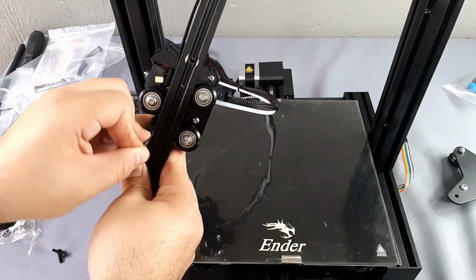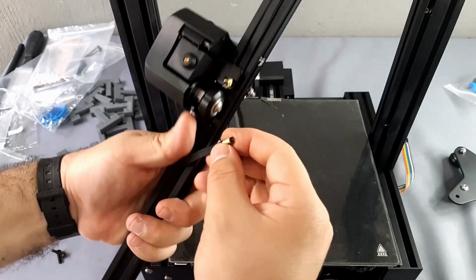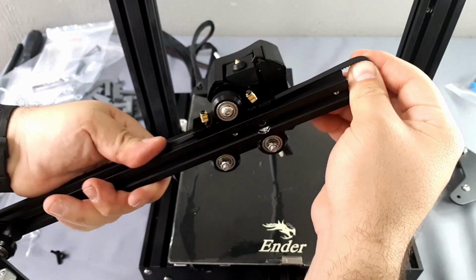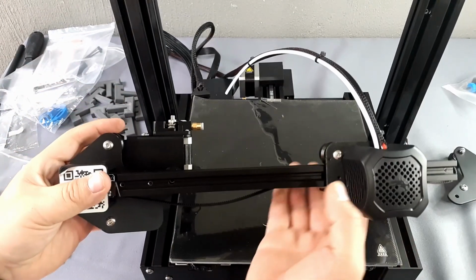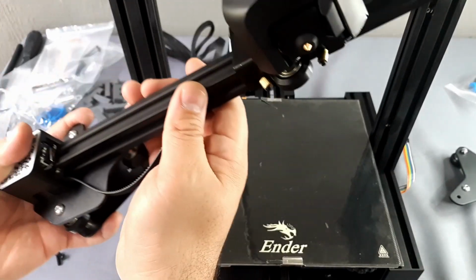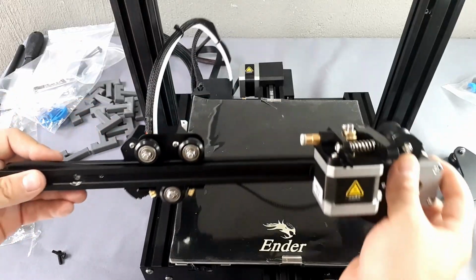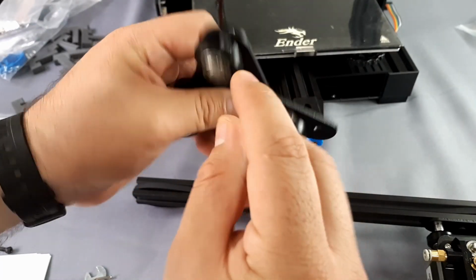To avoid making that mistake, we show it: the belt has to be attached to the lock, as you can see in the video. The excess that you see on the right is necessary for the adjustment. Turn the shaft to place the block at the other end. Like the wheels of the bed, the fuser has an eccentric nut for the necessary adjustments.